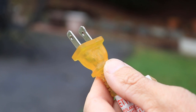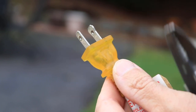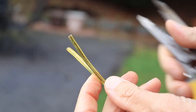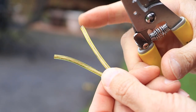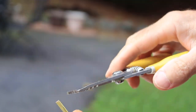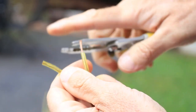I just wanted to point out a couple of things on the end of this cord. You have a small prong and a larger prong. The small prong is the hot side of the plug, and the larger prong is the neutral — or ground — cold side. If you notice on the cord, one side is going to be smooth and one side is going to be grooved. The grooved side goes to the neutral side of the plug. You don't want to get this backwards. So observe the plug and look for the grooved side, and make sure you get that on the neutral side. If you don't have it peeled already, a pair of wire strippers works great — just give it a squeeze and that's all there is to it.